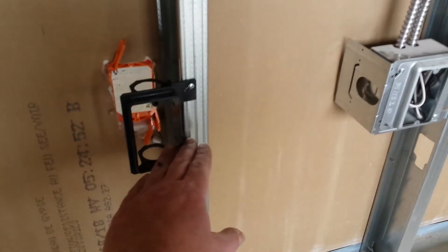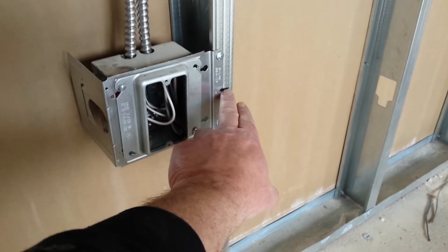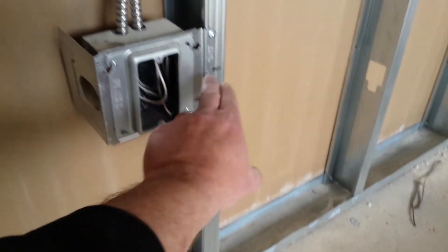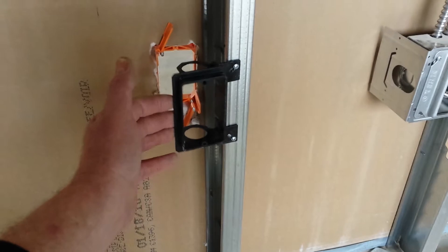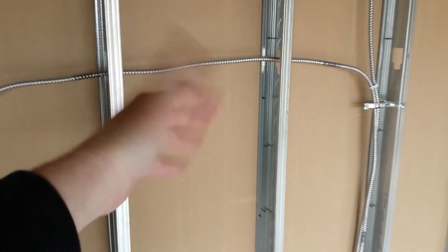If you are the electrician on the same job you can basically go from that. Here we didn't do it on our boxes, but an easy way is to measure — that's what they call centering — and there's even a little divot here from the electric box. Once you find the spec from the floor, just mark it right there in the middle. We didn't need to do it because we just eyeballed it, and then we just use self-tappers.